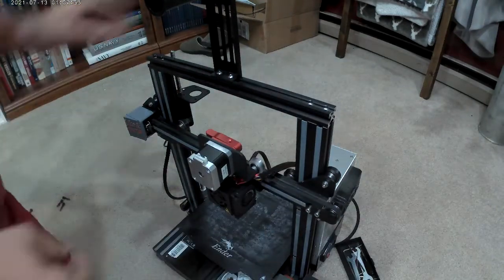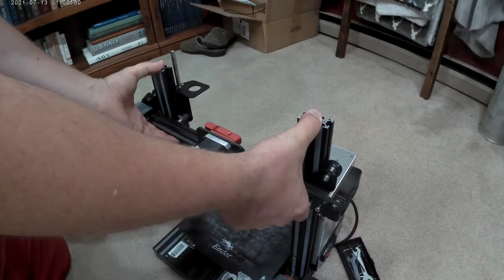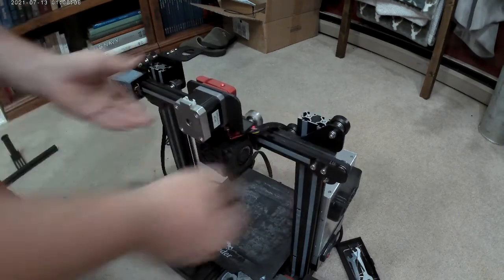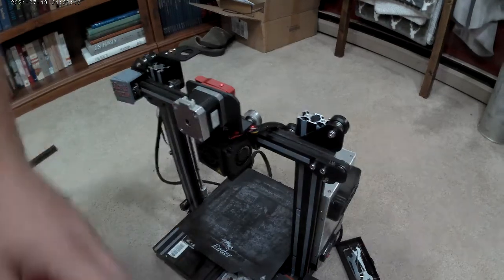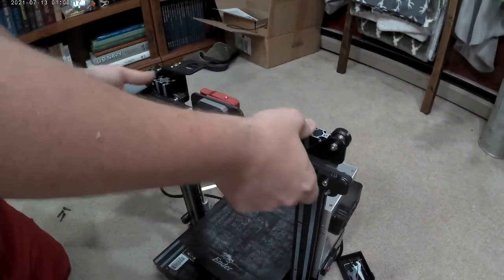Take them off, and I'm going to pull off the extruder bar. It just comes off. I'm going to put it to the side because that's got to go back on. I'm going to pull this off right off the top, nice and slow, because if you go too fast, this actually provides power and will light your board up down here. I don't even know if you can see my board. The board down here, you don't want it doing that. That could be bad.